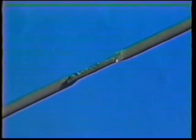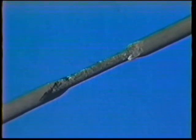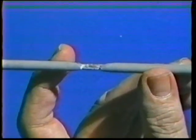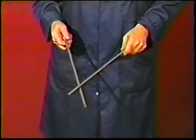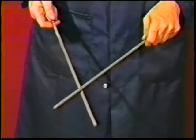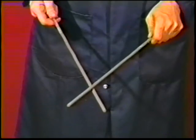Like other kinds of covered electrodes, the low hydrogen electrode is easily damaged by rough handling and is very prone to moisture pickup. Before you weld, inspect the electrodes for chipped flux coatings. This will not only cause pinholes in the weld, but will also produce an erratic arc and hard zones in the weld. Also, look for evidence of moisture on the flux coating, such as stains or a damp feeling. If the electrodes are lightly tapped together, they should produce a hard clicking sound. If the sound is more like a dull clunk, the electrodes are damp and are not ready for welding.